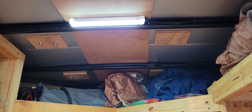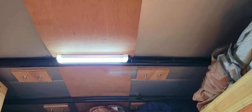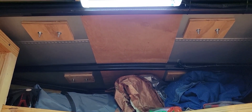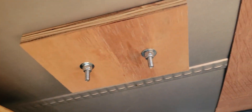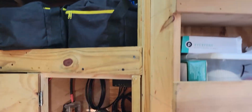So the solar panel — we got it mounted up. It's very thin sheet metal, and in our opinion it wasn't going to hold a lot. So we added some three-quarter inch plywood, five by seven squares. Went to Lowe's, got some better hardware — stainless steel with locking nuts — and just mounted it like that so it's a bigger footprint. Alright, everything's tied in.